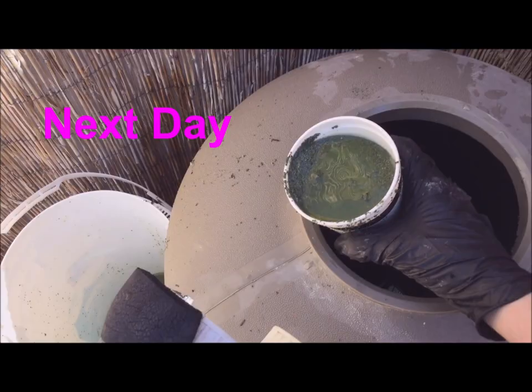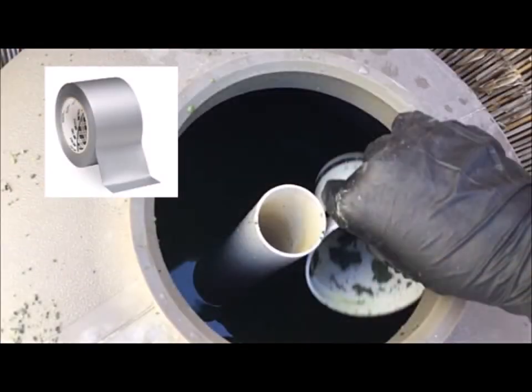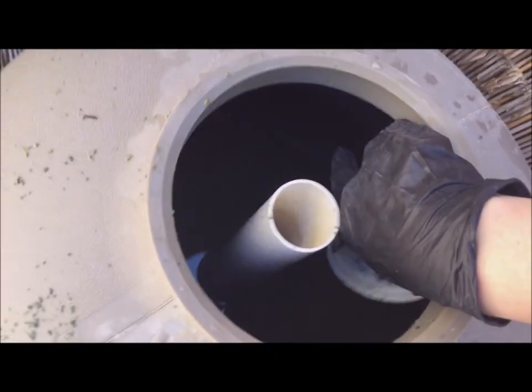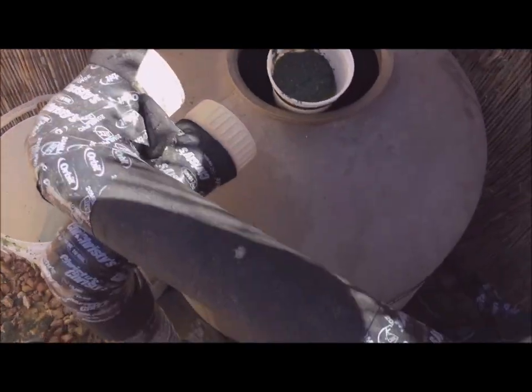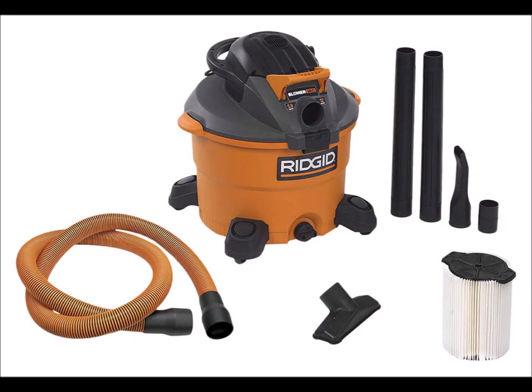This is the next day — I knew I needed to be well rested to scoop out all that ugly wet sand. Be sure to wear gloves; there are contaminants in this used-up sand. The way this sand filter works: unfiltered water from your pool goes through the media — sand or filter balls — gets cleaned, then goes through the laterals, and out comes the clean filtered water. Scoop after scoop, that's the way I did it. I removed several buckets of sand. What would have made this job a lot easier? A wet/dry vac.